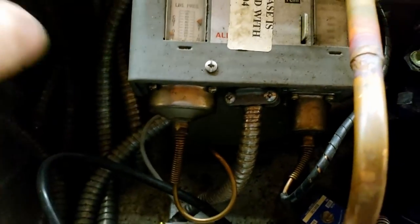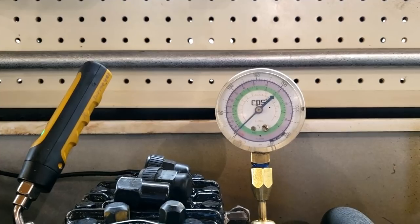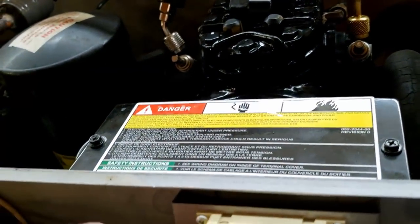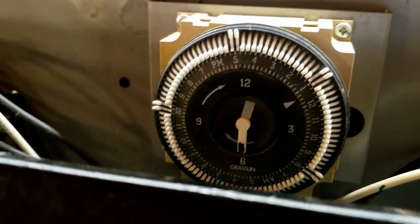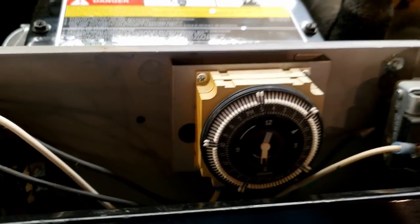Okay, it goes down to the top there. I can see the sensor in there — it's in the air band, in the back wall. So they're doing it based off discharge air, and a lot of their sensors are done that way. They must have that sensor in the coil. Adjusted the pressure switch a little bit — it's actually shutting off right at about 5 pounds and still holding. That sensor is right above the coil, very likely driven down into the coil. I'm going to advance the clock right up to the point where it could go into defrost and see if it can push itself into it on its own.